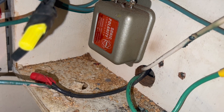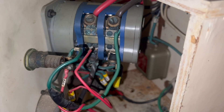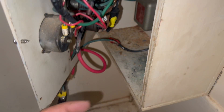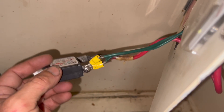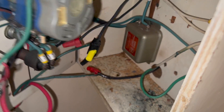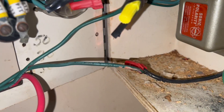So really dangerous. We're going to rewire this - I'm going to put in a new breaker panel tomorrow. We're just wiring it right now with new proper cable. They're 110 units with a new breaker system. The power from the switching will come down to the main breaker and then feed off into the other two legs. Remember the other day we were talking about double tapping? That's what's double-tapped and that's what happens - it scorches it. This whole thing is garbage. Wire nuts, electrical tape - I don't want to touch this stuff.